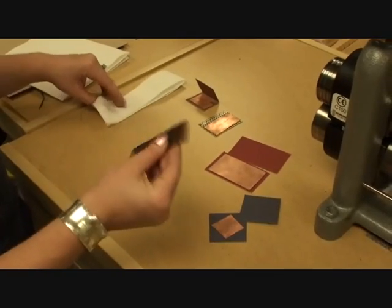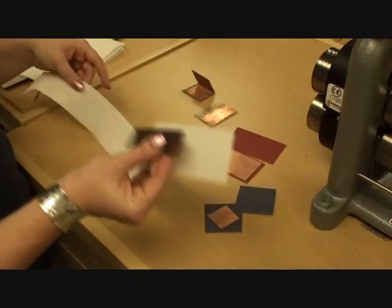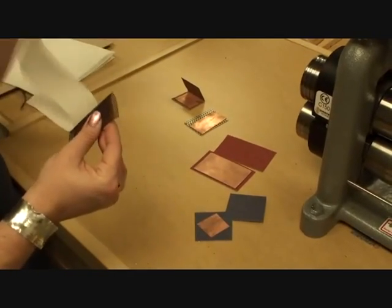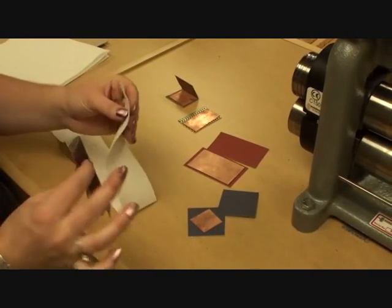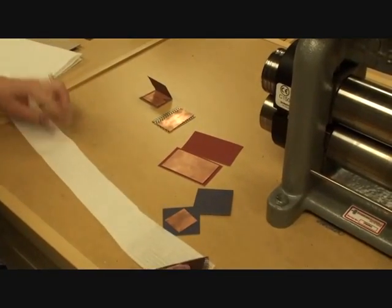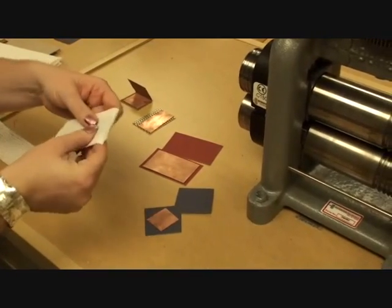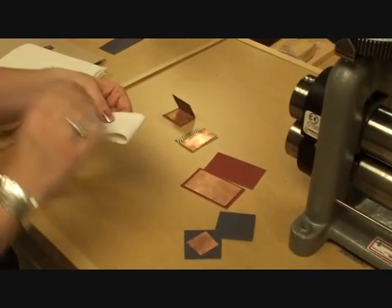One of the things that I'm going to do is just pad this with some paper towel. Now, I've heard that the best kind of paper towel that you can use is that really flat brown stuff that you usually find in public restrooms, kind of the cheaper stuff. It doesn't have any kind of padding to it whatsoever, but I don't have any of that, and a regular paper towel will work. Here I have 3 sections, so I've just cut off a long piece of this, and I want to wrap this around, or at least have enough to wrap around so that I have 3 layers on either side. So you want to be able to turn your piece 6 times.